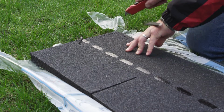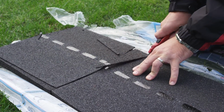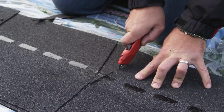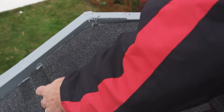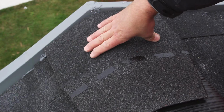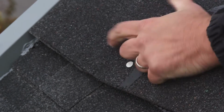In order to cover the ridge and hip rafter, cut sections from rectangular Superglass 3-tab shingles. Bend 3 shingles together to prevent any cracks. In extreme cold, you should preheat these shingles. Always start on the side of the prevailing winds, and for the hip at the bottom of the roof.